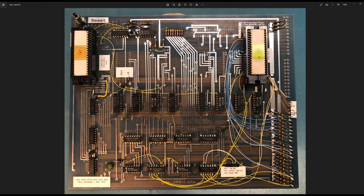Both devices are soldered directly to the board — there was no reason to socket them, they're just jellybean TTL. I used later date code parts grabbed from my bin — I wasn't worried about date-code-specific TTL. Most of this is from the '80s and '83, there's actually a '93 in there. I just didn't worry about it.